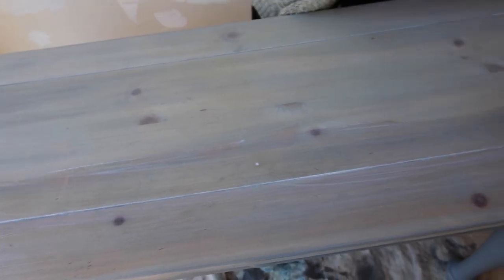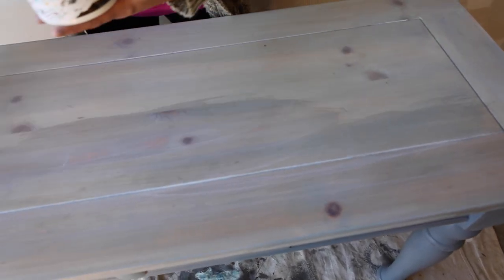It's all natural and water-based and it'll come right off my brush with soap and water, totally safe to seal inside. Even though I used the Cottage Colors with the built-in sealer as a faux stain, because I watered it down, it messes with the integrity of the built-in sealer, so it needs more top coat. Hopefully that makes sense. That's bringing the colors out real good though.